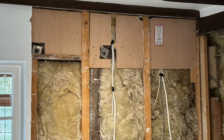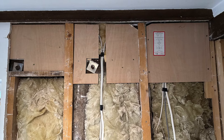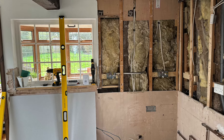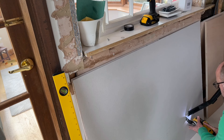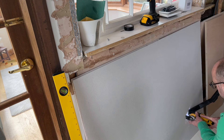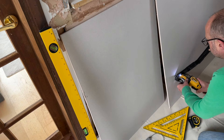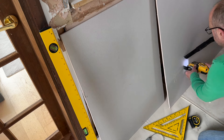That's one wall done and hopefully I should get some decent fixings in this. Time to add the first sheet of plasterboard. First I wanted to cut out the sockets - I'd measured these already. If you're wondering, I haven't got three hands - that's my wife holding the vacuum cleaner so we can capture any dust, because as you know it goes absolutely everywhere with plasterboard.